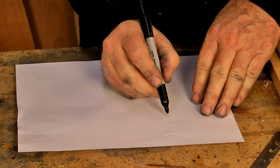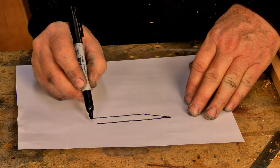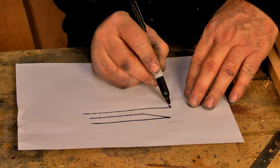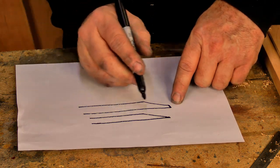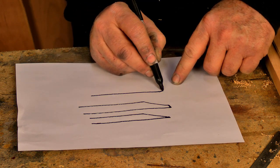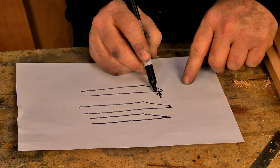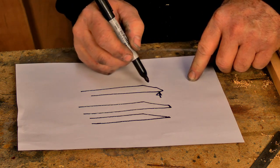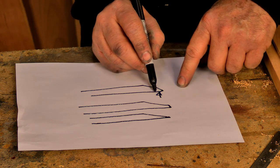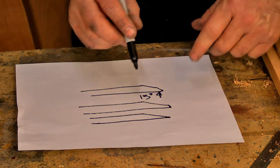Let me draw this for you. This is a low angle plane — the blade goes like this, and you put on a secondary angle of about 40 degrees. Now a back bevel goes on the other side. If the back bevel is too steep, then between the back bevel, the primary bevel, and the secondary bevel, the flat part will glide along the wood and the sharp edge won't touch the wood — so you won't be planing anything. You've got to watch that. I usually like to drag the back maybe a few times and put about 15 degrees on it — 15 degrees or a little less.